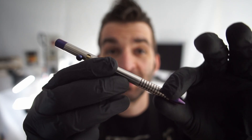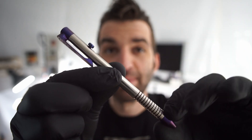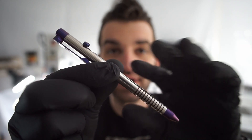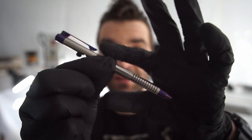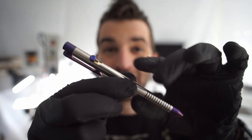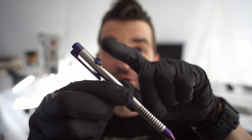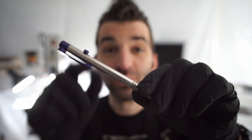Every single part on here is polished as well - hand polished up to the same finish level - which is a scratch and fingerprint magnet. That's why I tumble my pens, because it actually gives a finish that's a lot more resilient to pocket carrying. But this one being almost more of a showpiece I just had to have it polished because the colors pop and everything looks so good. The internal diameter on this pen has also been polished just like the outside, so you get a super smooth surface for the bolt pin to ride on, which is absolutely lovely. I don't want to go back to not having polished surfaces on the inside.